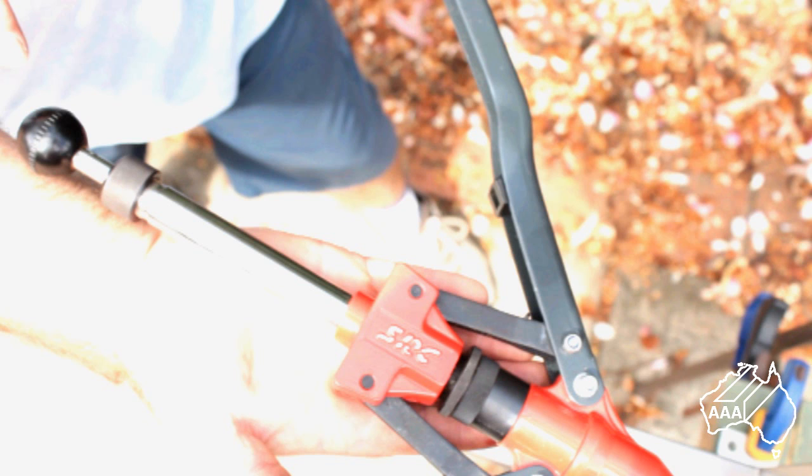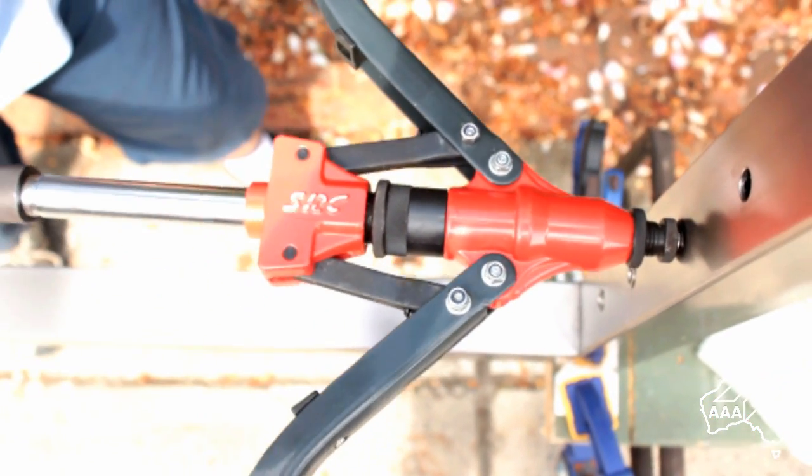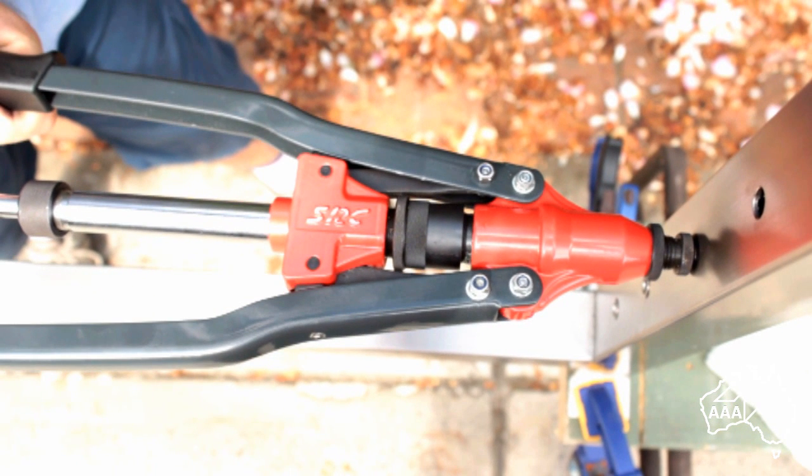The distance the blind rivet nut inserts screws into the mandrel can be adjusted depending upon the thickness of the tube. We usually pre-adjust the blind rivet nut tool to work on tube with a wall thickness of 1.5 to 2.5 millimetres. If your tube is thicker, the blind rivet nut tool will have to be adjusted. Next, push the blind rivet nut into the drilled hole and squeeze the handles together. This will crimp the blind rivet nut to the post.